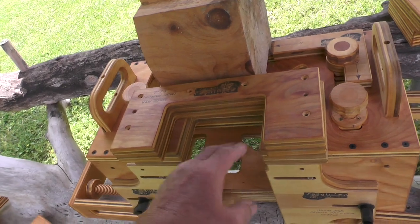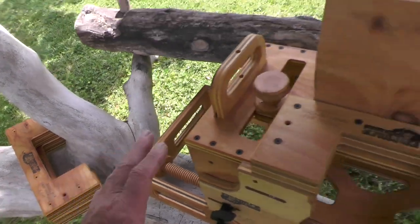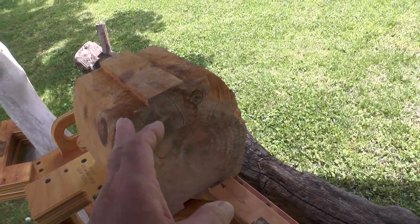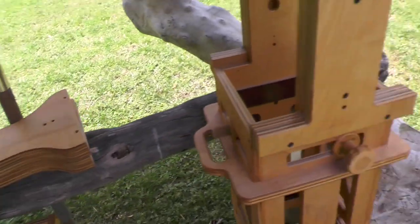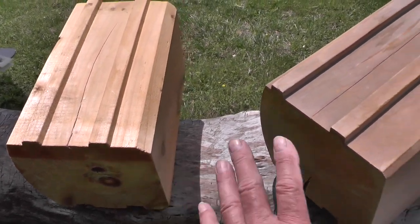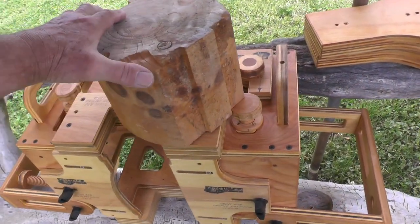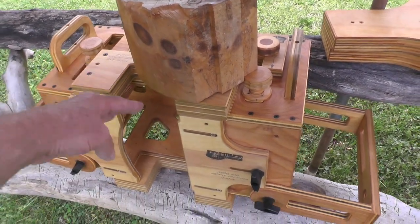This one's a little larger than the one that's already on the jig, so that's an optional feature. The depth would depend on how deeply into the log you wanted to go with a notch. A minimum would of course be any features on the log, whether it be a round or in some cases going into the side log at least as deep as the chamfer here. So when the logs are butted together, we don't have any clear passageway through the joint. Getting a notch in the side of a log is really not an issue — it's pretty simple depending on the width and depth of our profile templates.